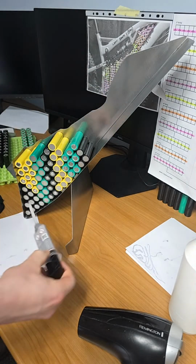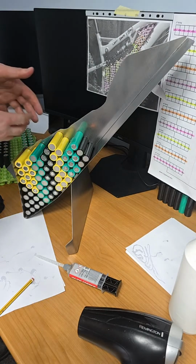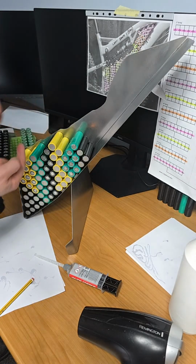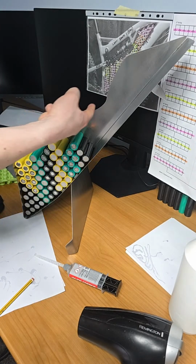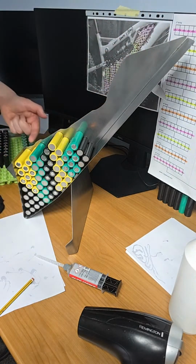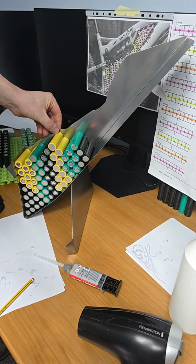So just to point out, the limit within the pack. I didn't want the cells protruding or extending up past the edge of this plate because that's my boundary. Okay, that is my boundary of the capsule. So I'm happy that that cell's down 3mm below it, where it's meant to be.